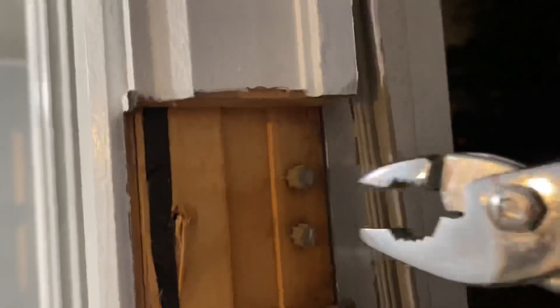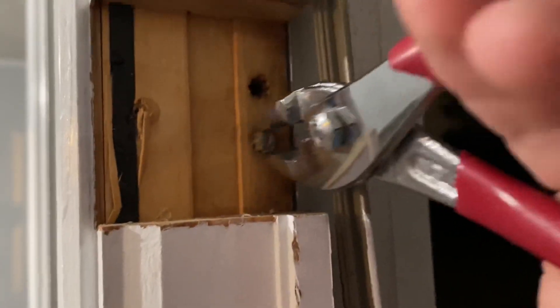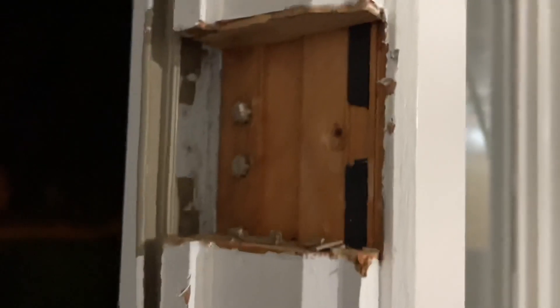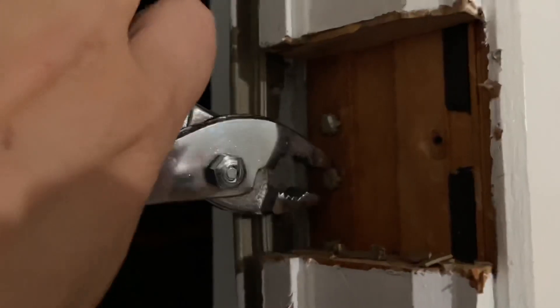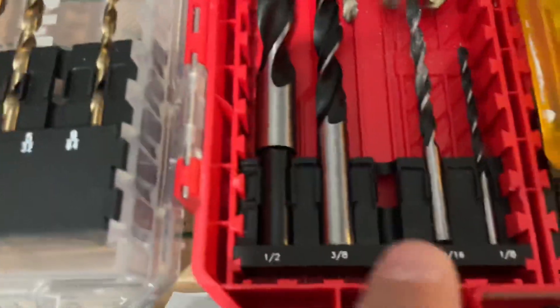Now I want to show you one that is warped. If the inserts get stuck in there, have pliers and try to lightly grab them and pull straight out. That one came out perfectly. But if it doesn't come out, you're going to have to drill it out. Let's see if we can grab this other one — and they both came out, awesome. But this lock in this window is really deteriorated to the point where even with pliers it will not budge.